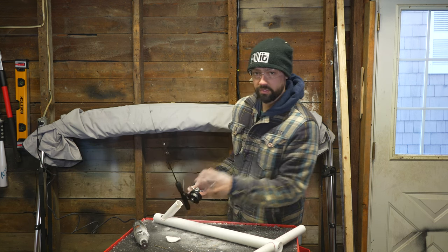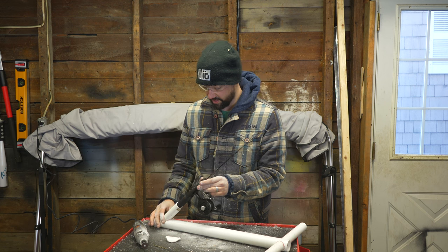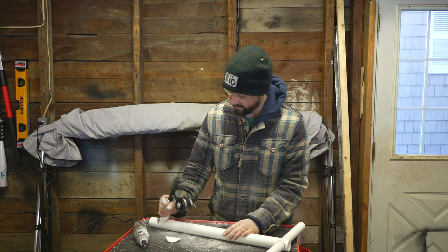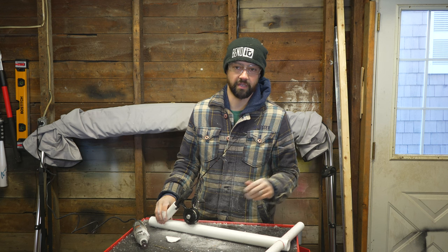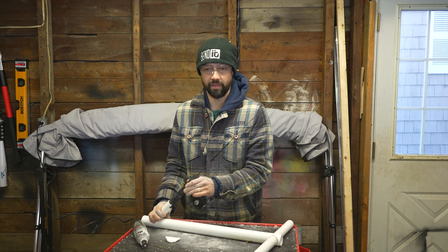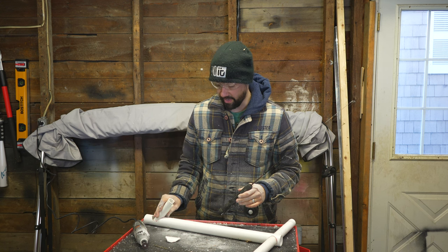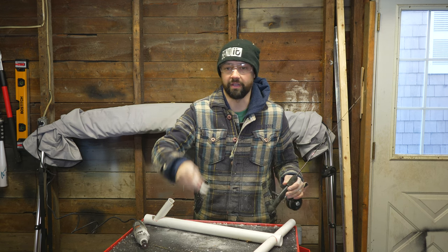This one I made a little bit loose — just a disclaimer: start the hole small so everything fits in there nice and tight and then ease into it. Start a little bit less zealous than I did. If you made it too big, you can use JB Weld or something like that to build the area back up. Make sure your hole is a little bit smaller and you want that at 45 degrees — start vertical and inch your way down by grinding out the top. You can also use your drill and drill a bunch of holes like carving a pumpkin, then go through it.